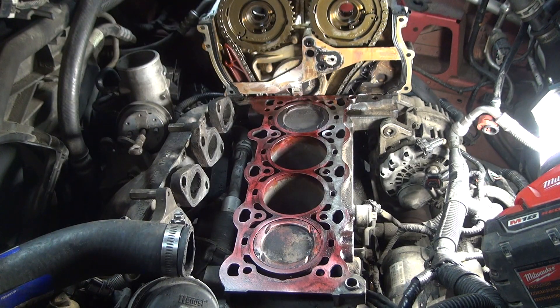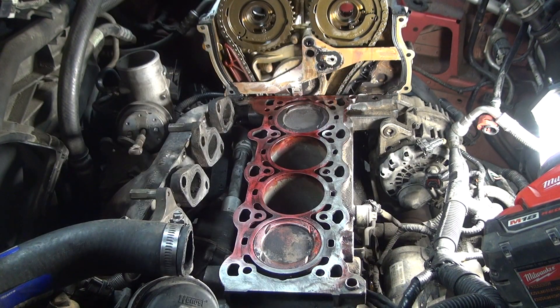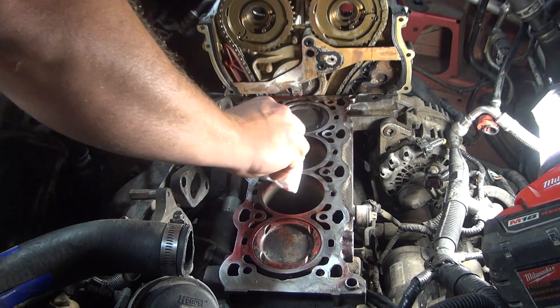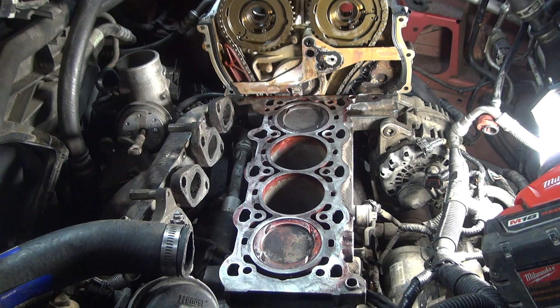Now with the cleaner, I just spray it onto a clean rag and wipe it off. You do not want to spray the cleaner directly onto the surface like a paint can, because you don't want to wipe the red dye out of any cracks. How it works: the dye penetrates and sinks into the crack. When you clean, you just clean the top surface. If there's a crack, the dye stays down in it. If you soak it with cleaner, the cleaner gets into the crack and you won't see it anymore.